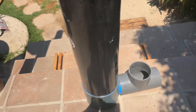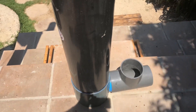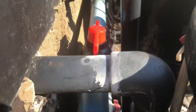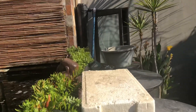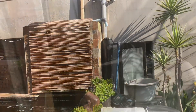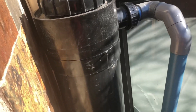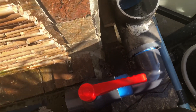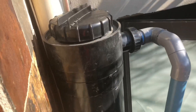I'll show you how I install this as we go. Right now I'm going to paint the structure just to make it look a bit neater, then we're going to start doing the actual installation. Water flow goes across the top, there's a tap in there and that pipe runs all the way along the end of the pond and up into the protein skimmer. Water pump through the top, going through all the bioballs down to the grid — about 20 centimeters off the floor. Foam comes up the top and flows through into the pond. That tap gets adjusted according to the flow so you can make it flow more or less and push up more or less foam. Very simple, took us most of the day. Not too happy with the pipework down the side — it looks a bit ugly — but that's my protein skimmer.